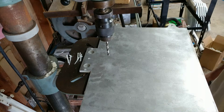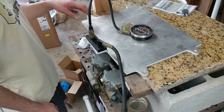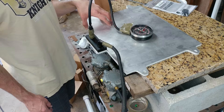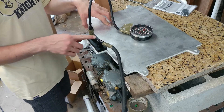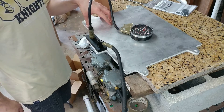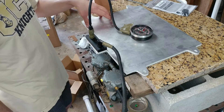Now I can take this plate and put the threaded adapter block on it. Because I'm not yet confident enough to put pressure on these without them being clamped into a stack, to check for leaks I've been using this vacuum pump which I've haphazardly hooked up to one of the adapter blocks, and then put a gauge on the other end so I can see whether or not there are leaks causing a loss of vacuum.